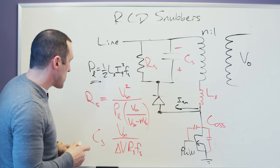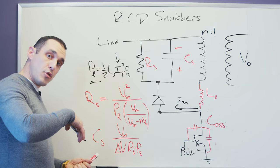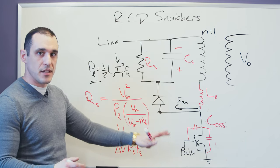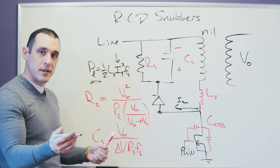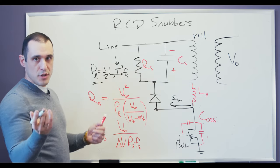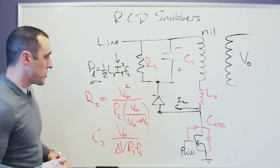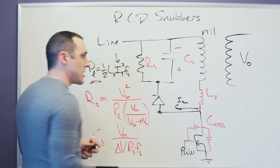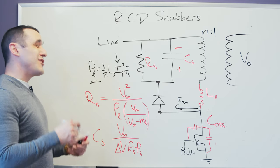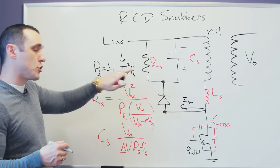There's one other thing that you need in order to do this correctly: you need to know what your peak current limitation is. If you go back to our flyback converter module, we selected the peak current limitation based on the capabilities of our switcher, because our switcher had this FET integrated into it — it had a drain pin on the switcher and that's where all the current goes. Switching frequency of course we also get to pick, based on the characteristics of your switcher. What about the leakage inductance? The leakage inductance needs to be measured. You can usually estimate it based on the coil inductance. If you don't know how to estimate it, a good approach is to overestimate the leakage inductance that you have on your transformer.